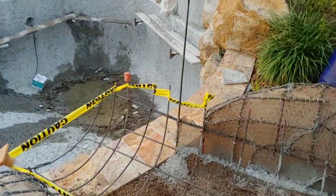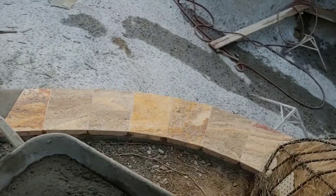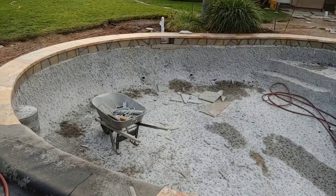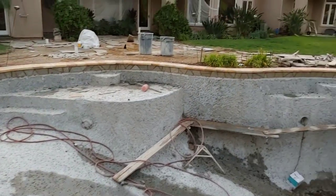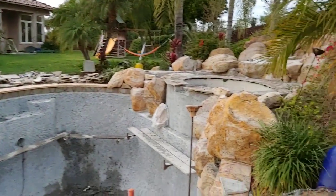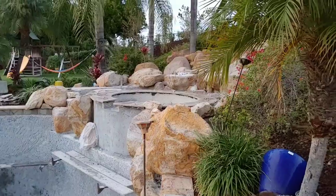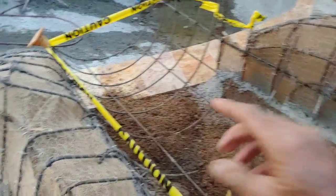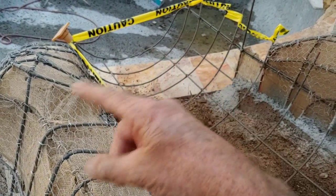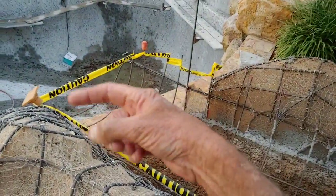They're doing a new terrazzo coping on this pool, which is really nice beautiful stone, and they're using flagstone along the edge. It had a bullnose stone and one-inch tile — a very popular approach years ago. Here's all the real rock they put together to make a really nice waterfall. It's a good idea to put a slip sheet underneath the rebar so the whole slide can expand and contract separately from the pool, otherwise it can cause a crack — and I've seen that right where you'd expect it.